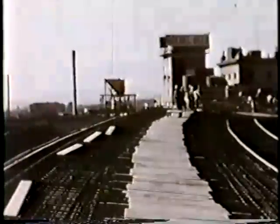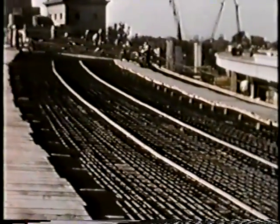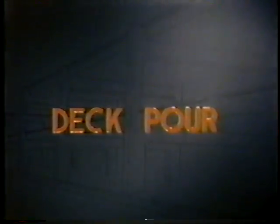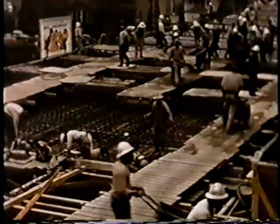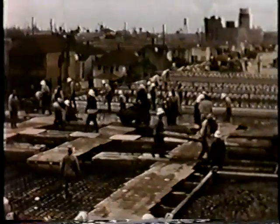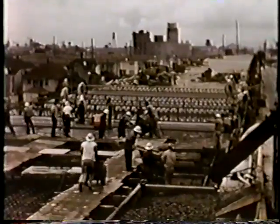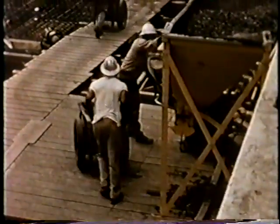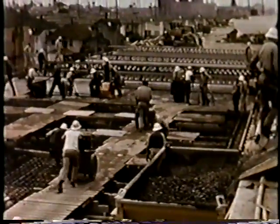The cycle repeated itself every third working day. All phases of construction are of equal importance, but the success of the job manifests itself to the traveling public in the riding quality of the deck. The 13,000 square foot three-span hinge-to-hinge unit involved a pour of approximately 300 cubic yards. Concrete was placed in five hours, with buggies placing concrete at the rate of 60 cubic yards per hour.